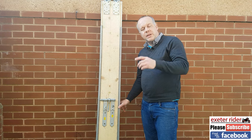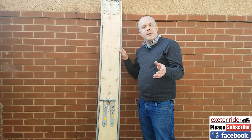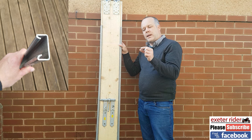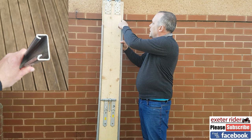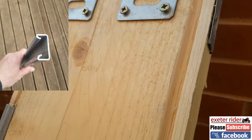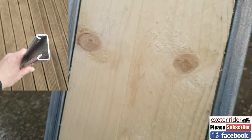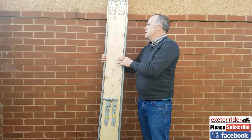The actual plank itself consists of this metal U-shaped tube known as uni-strut — that's the actual brand name. If you search any electrical online wholesaler, most of them will sell something like this. It's good stuff because it's really thick and really strong. What I've been able to do is rebate a line on each side of the board all the way down, get a nice tight fit, and bang the U-channel on. That's given it much more rigidity, so there's a lot less stress on the scaffolding plank itself.